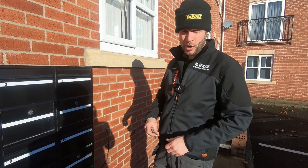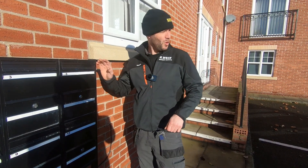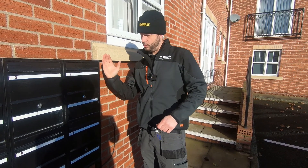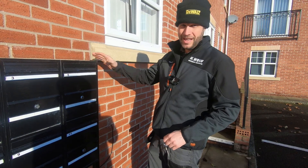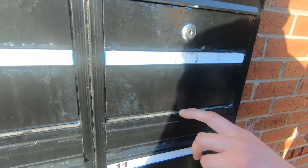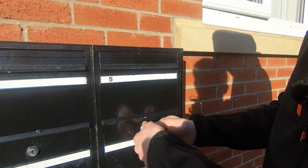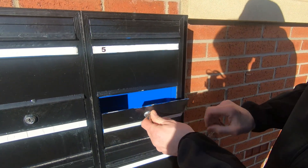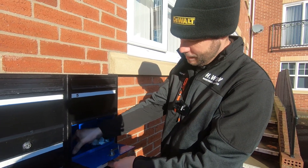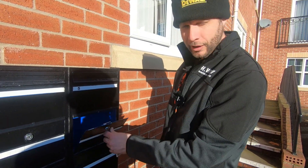Right, so here we are, job number one. I've got this letterbox here, it's leaking water in - it's number five. I had the same problem over the road and it was actually the letterboxes were all leaning back so the water was tracking in, so I just eased them over. I've had a spirit level on these and they're actually leaning forward, so it's not that. If you look along there, I've got a seal there, some sort of brush seal that doesn't look too good. If we look inside, you can see the guy's put that in to keep it dry. So what I'm going to do, we're either going to try and get some sort of seal to go on there, or build a little plinth type of thing that drops inside so it'll keep his mail off there and then obviously the water will run out.